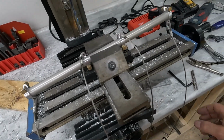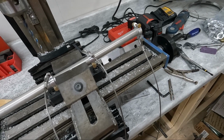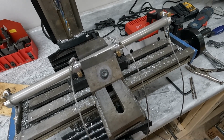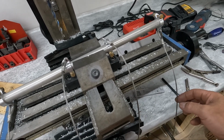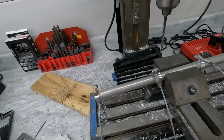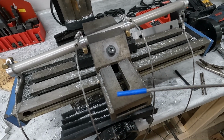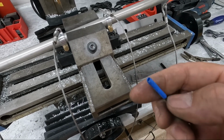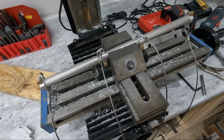Hopefully none of these cables are too short. I cut these cables that go to the front about 90 inches, which is supposed to be almost 10 inches longer than they need to be. So hopefully they'll be fine. So let's go ahead and install this in the airplane. I'll get the rudder pedal tray installed too, and we can feed these through the rudder pedals. And the only other thing I wanted to mention here is it's always a good idea to tape the ends of your wires or cable that isn't crimped, just to make sure that it doesn't unravel too much. I just put a small amount of tape on here. It still should fit through all the cable guides. So let's go ahead and get this installed.